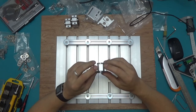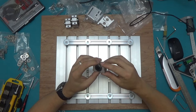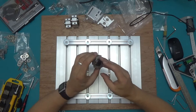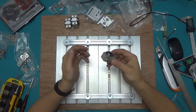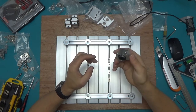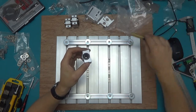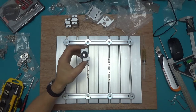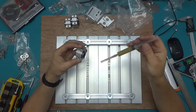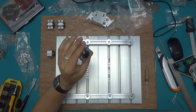After looking more closely at those linear slides, I noticed that when I pushed the guide rail through, quite a bit of some sort of oil leaked out. I thought they were fully lubricated, but then it dawned on me — that oil is not for lubrication, it's just a preservative so they don't rust in storage. That explains why the slides are rattling and why the gantry sounds so dry when I move it. I've got some multi-purpose lithium grease in a syringe here and I'm going to stuff all the bearings with grease so hopefully they'll last longer.